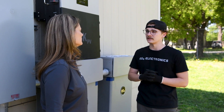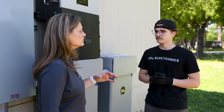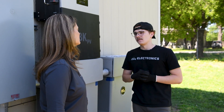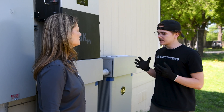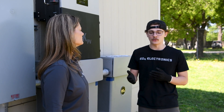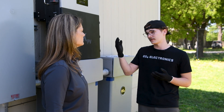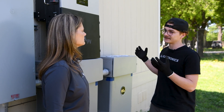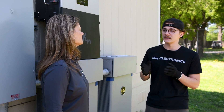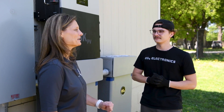For us it's about two days of off-grid runtime. If you want to sell back and get the most bang for your buck, our system can actually sell back through the batteries — you charge them to 100% via PV, set your time-of-use settings for a force discharge, and discharge your batteries back to the grid to make extra money, especially when rates are higher.